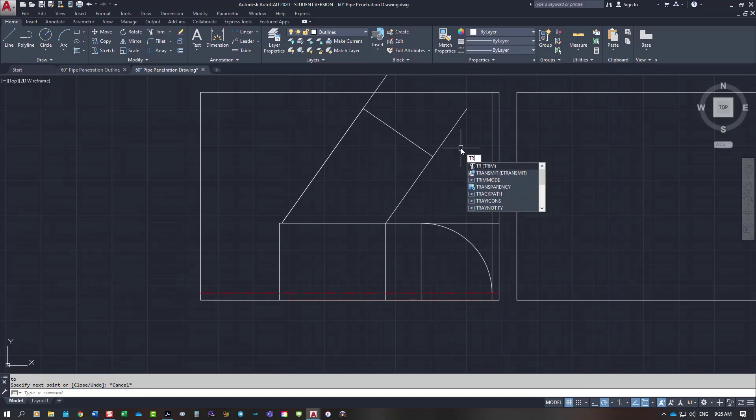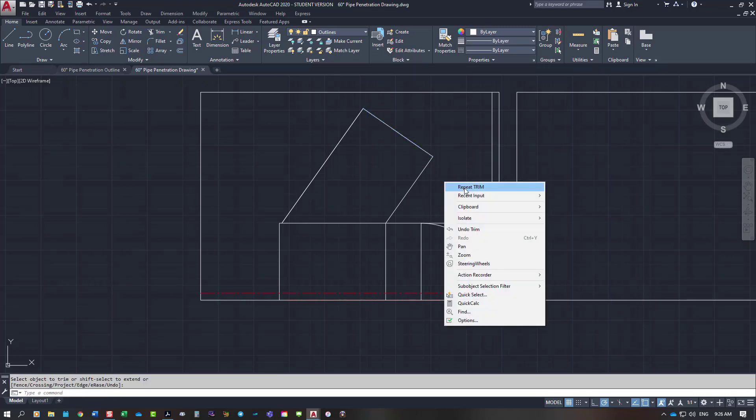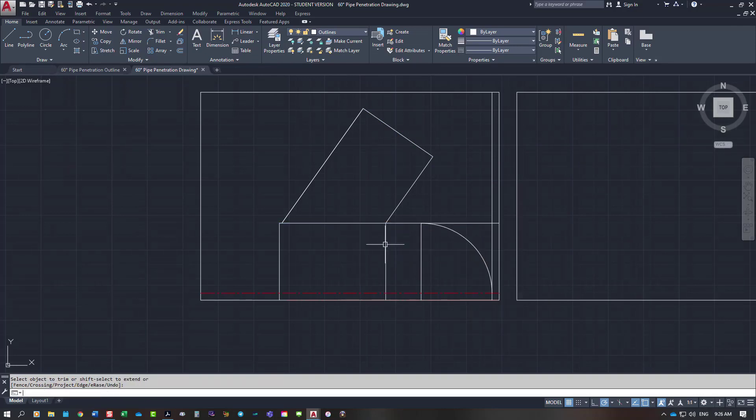I need to trim some lines off here and extend one along another 50 mil. I'll get rid of that line and put a center line through there at 60 mil, then offset the center line and extend it down to the baseline. On top of that I need to draw a semi-circle. I'll probably go off the sheet slightly, but yours won't because you'll be at the correct size — 100 millimeters OD minus material thickness — so your dimension across this face would be 95 millimeters.